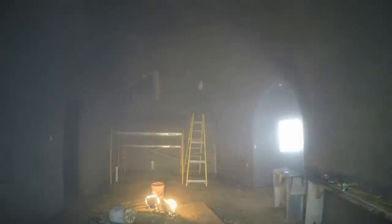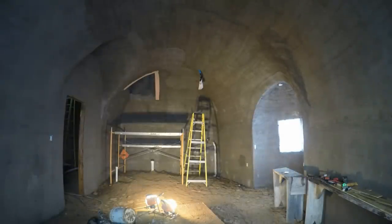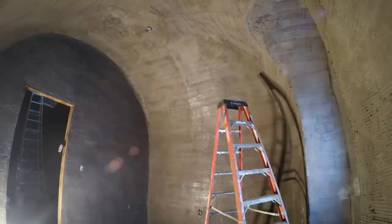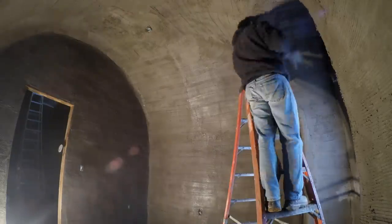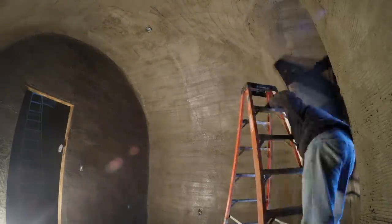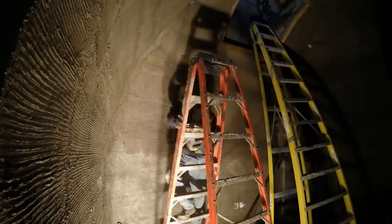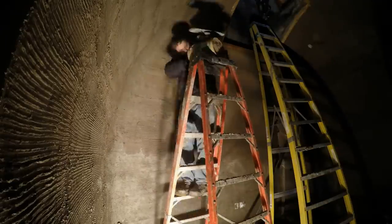Welcome back to part two of this marathon effort to stucco the bedrooms. Stucco is applied in layers. The first layer is the scratch coat, which helped a lot with smoothing out the walls, covering the lath, and setting up a good base for the next layer. You can see that we literally scratched the stucco on the walls so the following layer would stick to it. The scratch coat was in an earlier video. This video is about applying the second coat, which most professionals call the brown coat. In these first couple clips you can see I'm patching some remaining issues before getting rolling on a nice uniform brown coat.